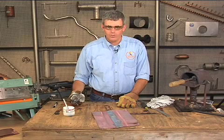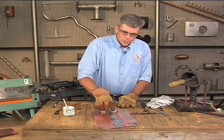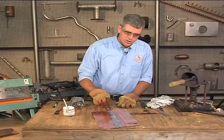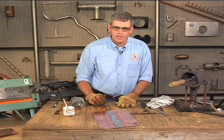After the solder is cooled, you need to clean residual flux with a wet rag. Once the joint's cleaned, visually inspect the seam, looking for any voids or gaps. These need to be resoldered immediately, or oxidation will occur, making it impossible later on.